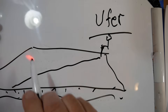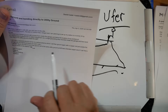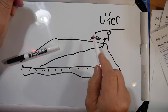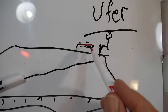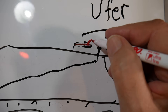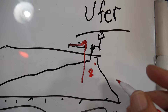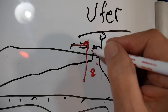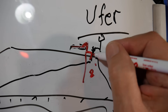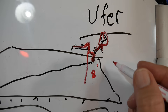Now, if you're going to put your station in a corner of the garage — inside the garage, below the location of your workbench — what you need to do behind your workstation is have a single point where you ground all of your equipment. All equipment grounds go to that single point, and then I would recommend going through the wall out to an actual eight-foot ground rod. Then bond that ground rod, coming in a hole right next to that UFER ground.